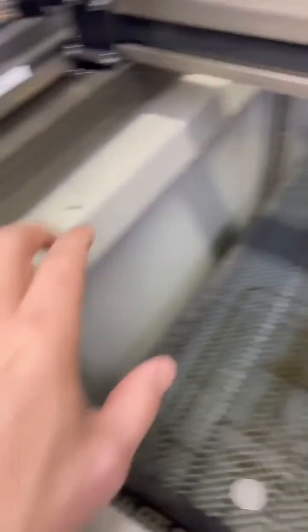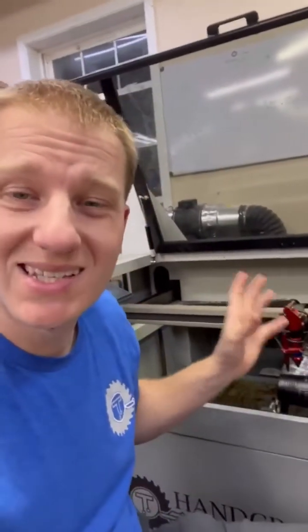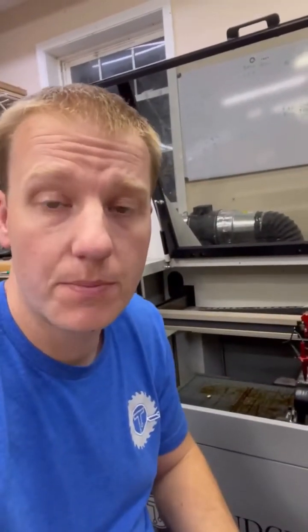Mine are pretty good — they may need tightening soon, but I have no slop or movement right now. That's a quick way to test for too much slop or not enough. If it's too tight, you can wear your belt out just as well as if it's too loose and you start skipping teeth. Just double check them and play with it. If you see any wobble, give it a little half turn to check it. And that is your reference on how to tighten or check your belts on the Monport 80W Laser.